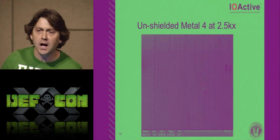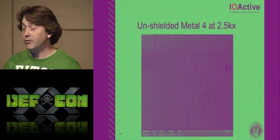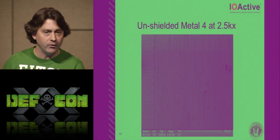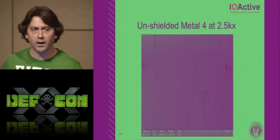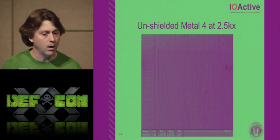And of course there'll be a clock in here. So what do I need as an attacker? I need the data bus, or maybe the instruction registers. That way I can induce glitches to change the behavior of an instruction being executed. And I need a clock because I have to synchronize with the chip's internal operations.